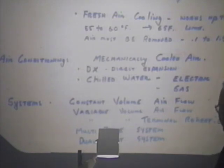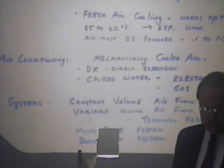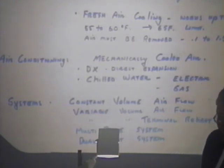probably 20, 25 years ago, natural gas absorption was used fairly commonly on a high quality building. If you have one of those, or if you find a gas absorber today and it's 25 years old, you need to run up a red flag, because that's probably the worst energy hog that exists anywhere in the market today. An old single stage gas fired absorber.